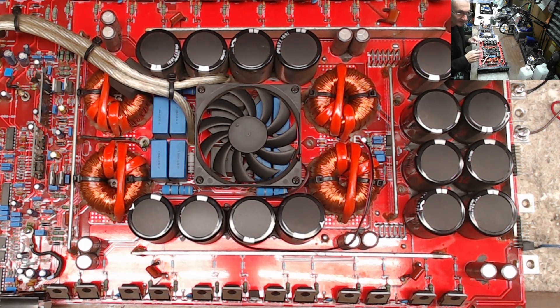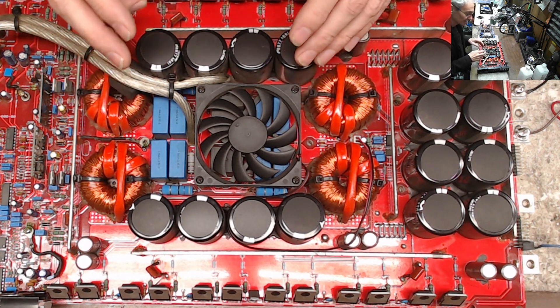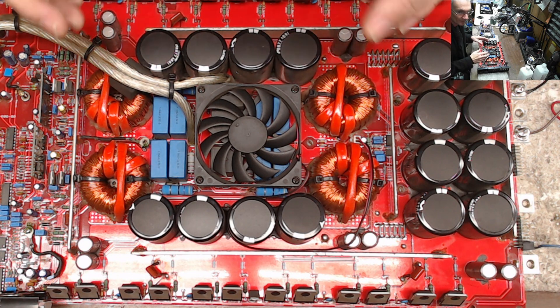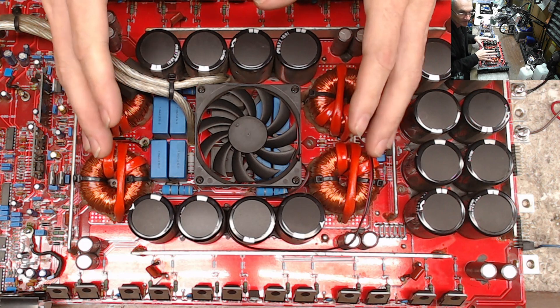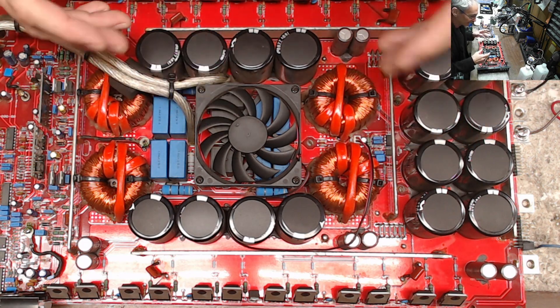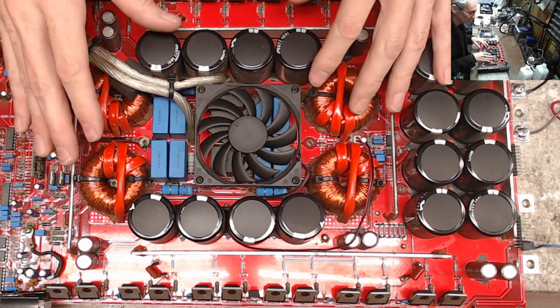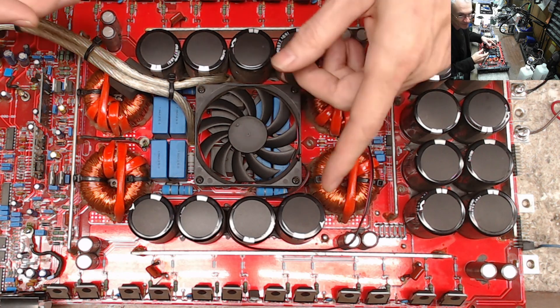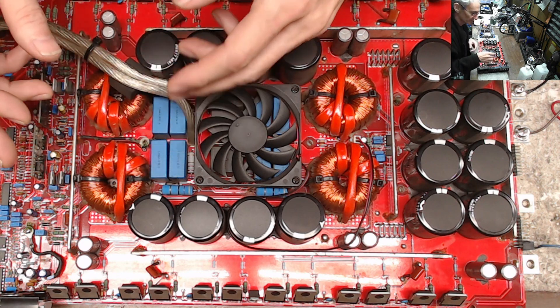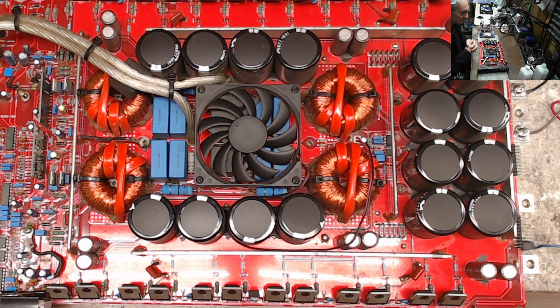The challenge with the Crescendo 17K or any S&I board using one or two output cards is how do you fire it up without running 100-plus volts of rail voltage and still be able to see the switching of the output section before sliding it all back together? I've had catastrophic failures from missed solder bridges — put it back together, fire up the amp, and lose an output transistor. Then you've got to replace transistors, Zener diodes, and drivers. It just becomes a huge headache, and it doesn't make financial sense at high voltages.